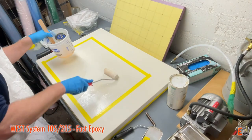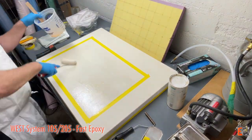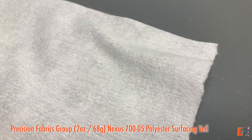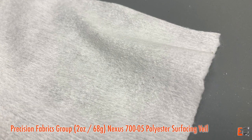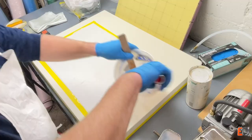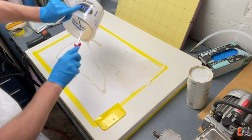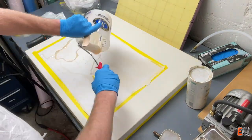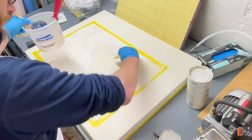Using some semi-permanent release here on this fiberglass surface. The resin is wet system, and I've got this roller that I'm messing with to wet it out. On this surface ply, this is a very heavy duty surfacing veil, usually used as a print blocker in infusion. It is wettable, but just by hand, and it's really hard to work the resin through.